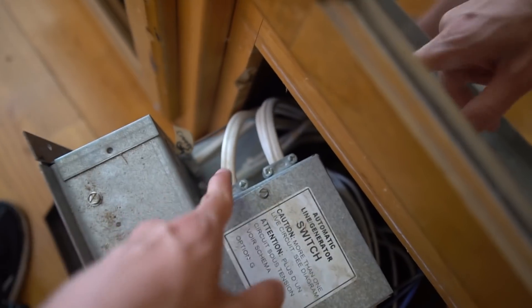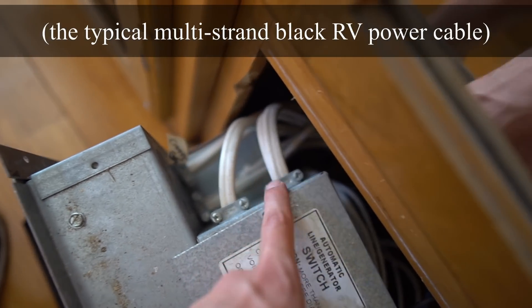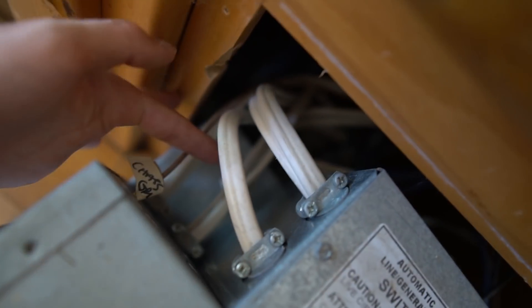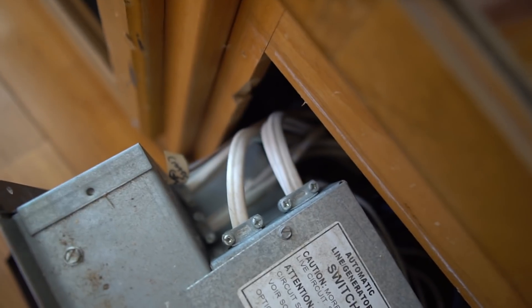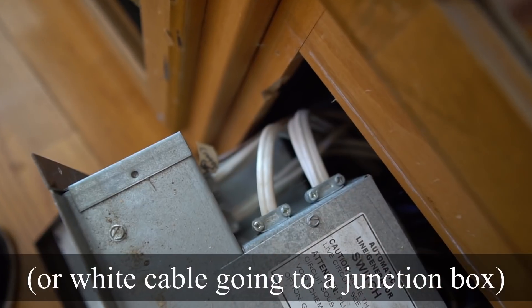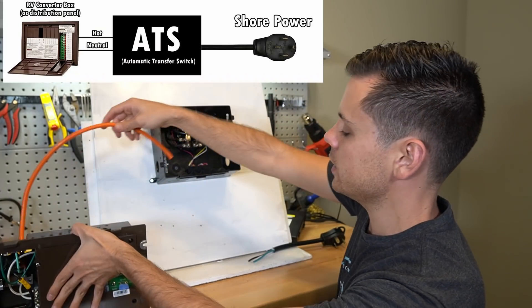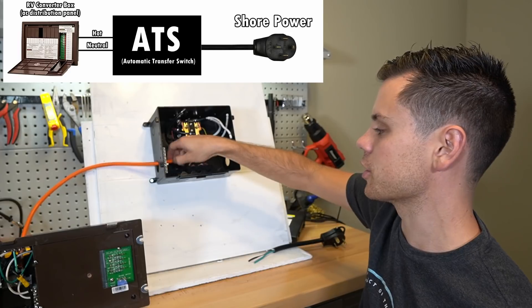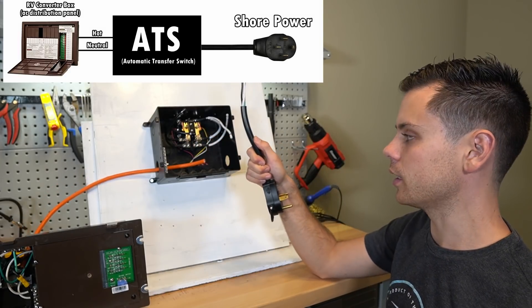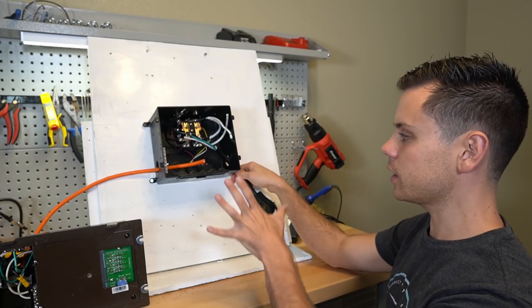You might have to find out how the cables are labeled — usually these are labeled. You have to figure out which one actually goes out to your shore power; usually it will be a big thick black cable, but that's not always the case. You may have to follow cables around or get a schematic. This cable needs to go into the automatic transfer switch box, and the RV power plug goes on the other side — just like that.